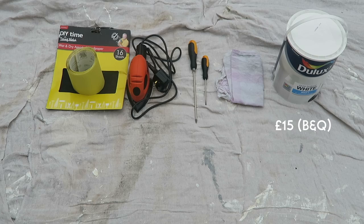The next thing you're going to need is paint. When it comes to upcycling, many people use chalk paint such as Annie Sloan and other high-end brands, but these are generally a lot more expensive, so in this specific video I'm not going to be using these paints. Instead, I'm going to be using Dulux matte paint because it can be used for the same thing. The only difference is that you're not going to get that chalk look finish. Ideally you want to use matte paint because it's thicker and has better coverage. If you have silk paint at home, use that — I started off upcycling with silk paint because that's all I had and it did the same thing. A 5-litre pot of paint is more than enough to cover a chest of drawers.